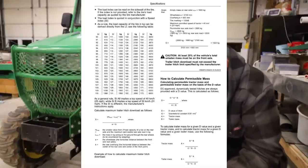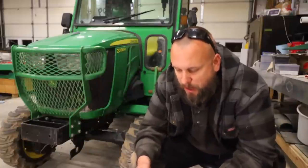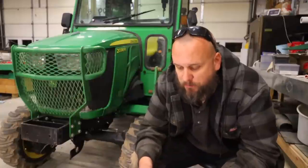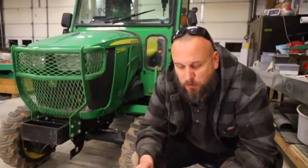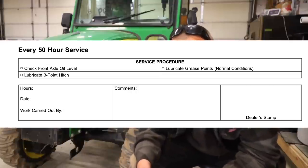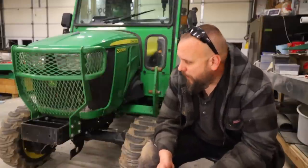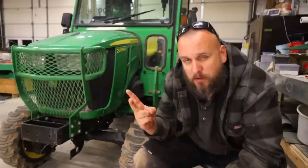Now we have all the service intervals. One I'd missed: I paid for my service plan, got all my service done, and was doing my own daily service and lubricating. But I was only taking the tractor in for 200-hour service. Every 50 hours you're supposed to check your front axle oil, and I was just leaving that to them — which means I wasn't doing it frequently enough. You can go through all of this and just verify that you're doing the maintenance you're supposed to do. My big takeaway is: do your own maintenance, read your manual, and try to familiarize yourself with the machine. Anyway, I appreciate you taking the time to watch this video. I'll put links on the screen to a couple more of our videos, and I'll see you next time.